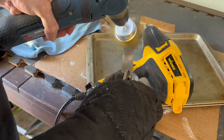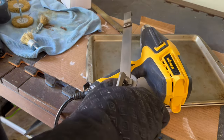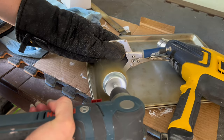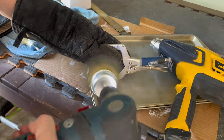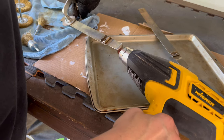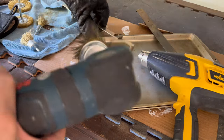Now, I knew they weren't real brass at this point, so I was very hesitant. What am I going to do with these? So what I decided to do is I taped them off, and I decided to use Brasso with Q-tips and a very delicate Scotch-Brite pad. And I just got off as much of the tarnish as I could because I didn't want to take them off. This is a 100-year-old piece, and so I really wanted to be careful with it.